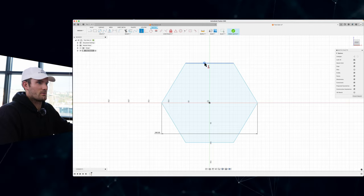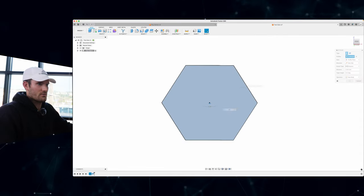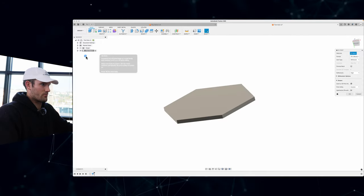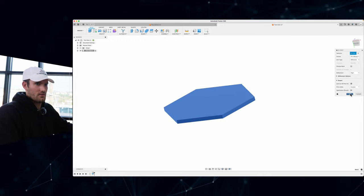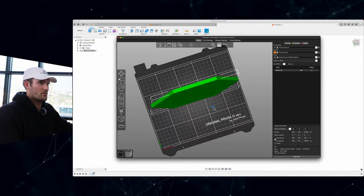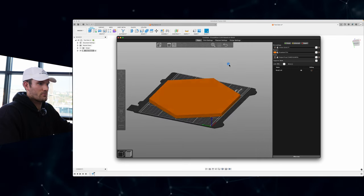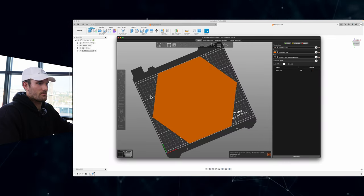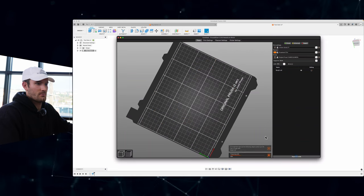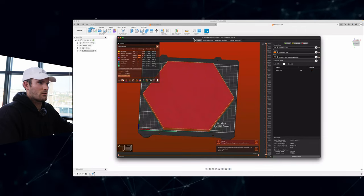This is just an example. I'm going to extrude something to get a rough shape — just the profile of the sign. Then we go to 3D Print, select the body, and send it over to Prusa Slicer. Here in my Prusa Slicer window, once I lay it down, you can see it's really close to fitting. The Bambu Lab actually has a slightly bigger print bed so it fits a little better, but if I try to slice this it says it's outside of the path, so I'd try a slightly smaller size.